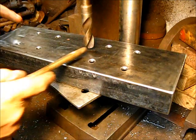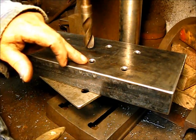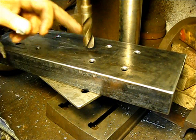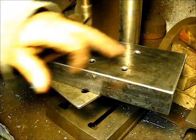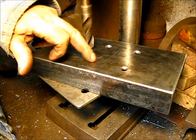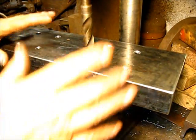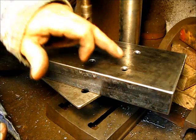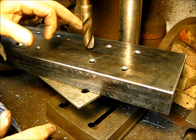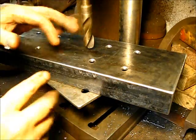A lot of home shops right there in the backyard don't have one of them chamfering tools — a lot of people don't have one of them. So if you want to chamfer that, just put an oversized drill bit in the drill press. As you do these you'll get a feel on the handle as to how much pressure, how much it's cutting. This is an old worn-out bit right here so it won't cut very much, but whatever size you got, put it in there and get her done.